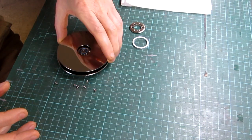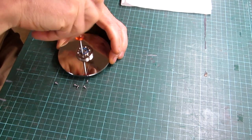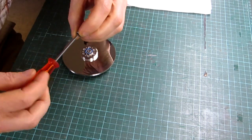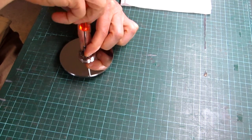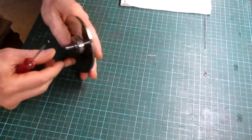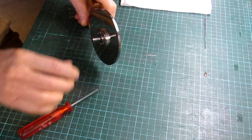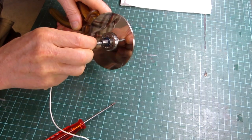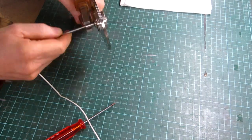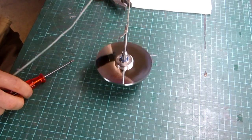I placed 3 discs on the motor spindle for extra weight. I also mounted a metal bushing on the spindle shaft. It needs to be tight. Then I screwed an M5 rod into this bushing. And now you have a spinning top.